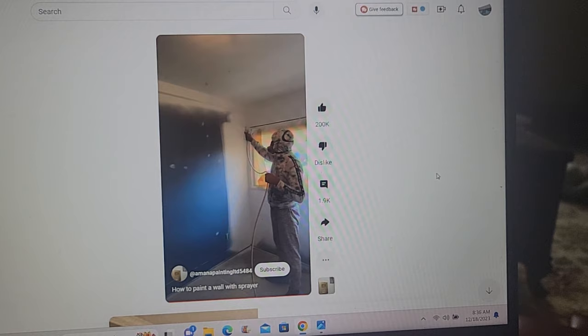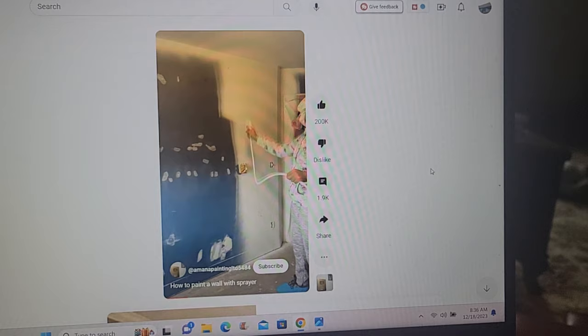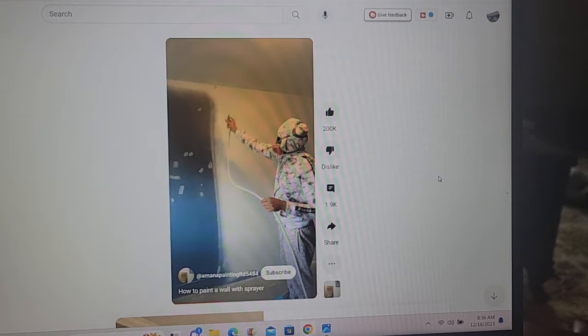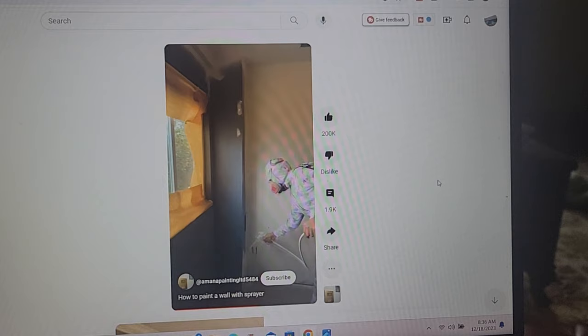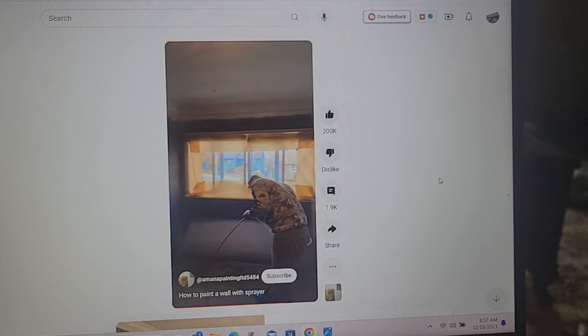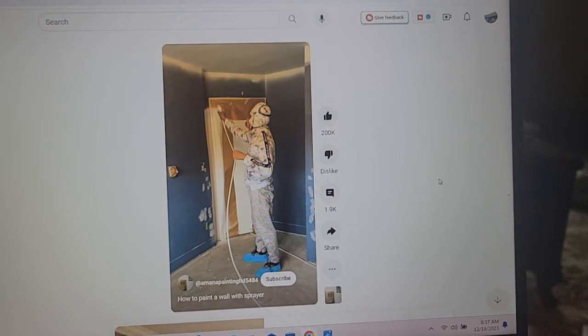Having your tip turned that direction is not the way the gun was really designed - that's for certain situations. Having your gun spray up and down, the only time I'll ever do that is on a commercial wall where there's nothing in there, the whole thing's completely covered, no T-bar, nothing at all, and I'll have a pole gun so I'm not bending my back. Some guys are saying his pressure is too low - that little bit of fan edge you're seeing is fine, that's not an issue. Maybe his tip's blown out - probably because he's using a reversa tip, which always leaves a little fingery edge. That's one of the reasons I don't use them.